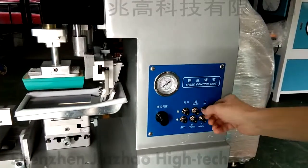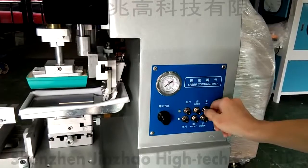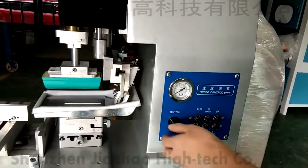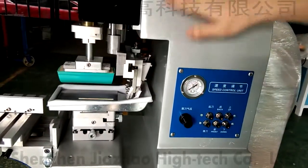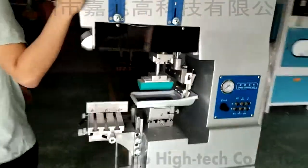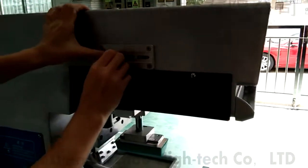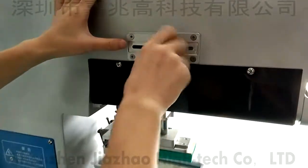This is up and down for here. Clockwise is the slower of the cylinder, and the anti-clockwise is the faster of the cylinder for the up and down, to control the pneumatic. And this is the pressure — you can adjust the pressure for this machine head. Then back to here. This one is the same. You can adjust the blade distance. I will show you — if I turn from here to here, then I tie it.